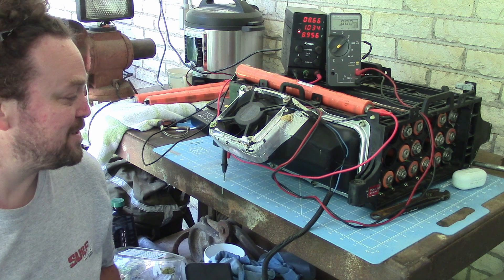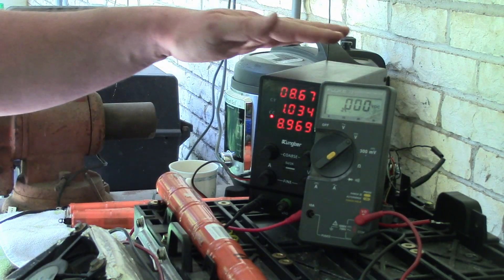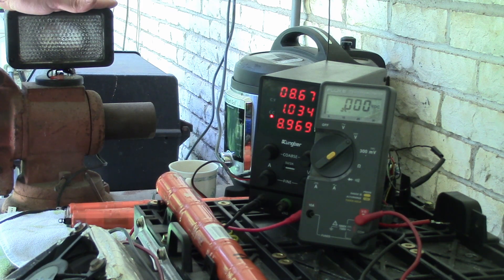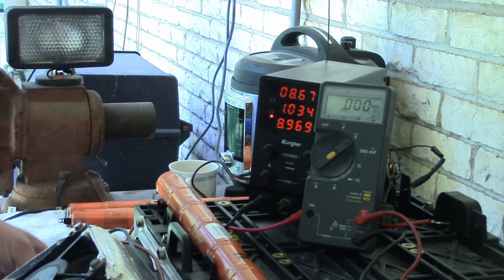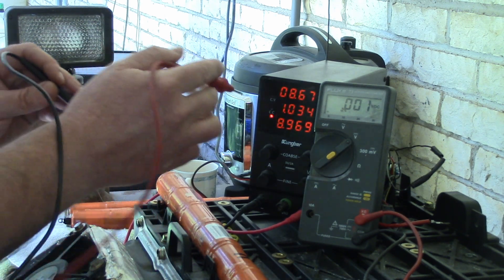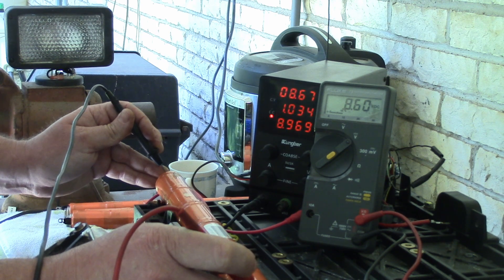After reading that, I started doing some investigation, and I could demonstrate all of this. So what we have going on here is we have a power supply, we have a multimeter, and we have a 12-volt light which I'm using as a discharge load. So in this stick — one of the ones that I've identified, and I've marked a couple cells as bad — it might have three bad now that I've been doing this investigation. It's charging at one amp right now and we can see the voltage is about 8.6.